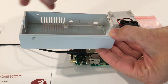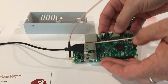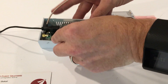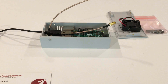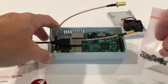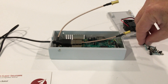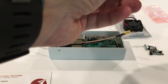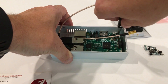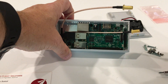Looking at the inside of the box, you'll see the hole for the audio connector, a partial cutout for the HDMI, and a cutout for the power. Line those up with the audio connector, HDMI, and power, keeping the pigtails up and out of the way. Just lay it in at an angle, line those pieces up, and it sits right down into place. Now, use the small black screws from the hardware kit to secure it permanently. These are ferrous magnetic, so you can use a magnetic screwdriver, which makes it much easier. All four screws go in, and we're ready to put the pigtail connectors into place.